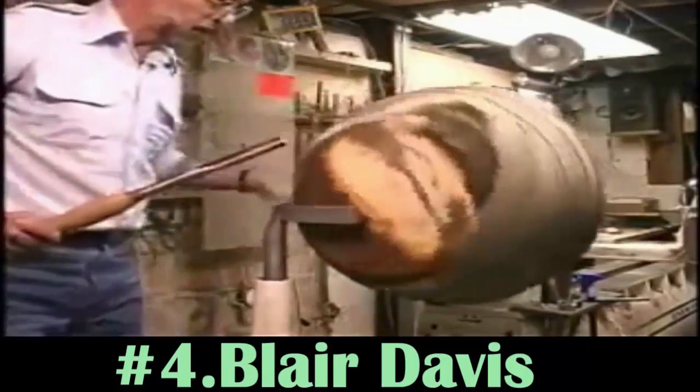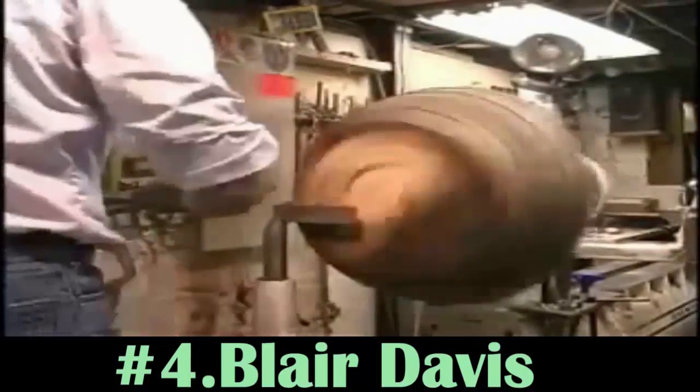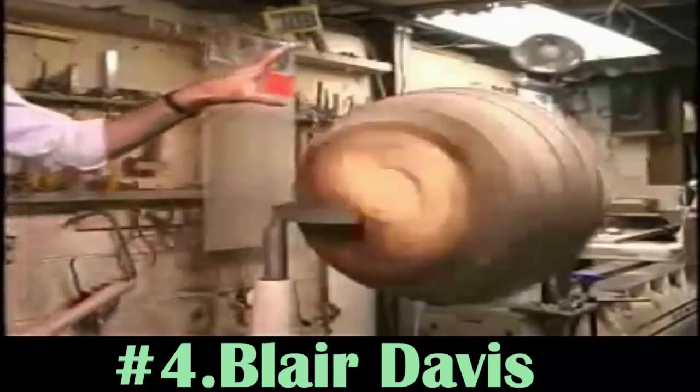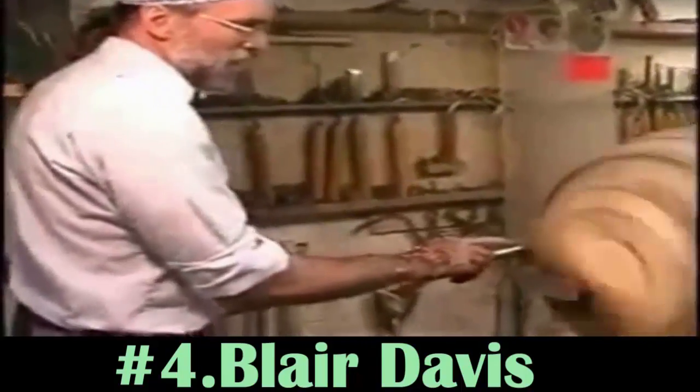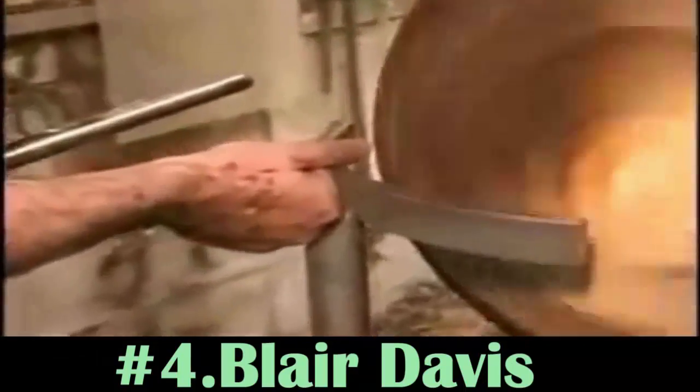Once again, we check for clearance. Even though it's more or less round, the difference in weight between bark areas and wood still gives it a fairly significant out of balance. As you can see here, I'm taking a fairly aggressive cut. I'm cutting probably half an inch of material off at a time, which you can do in green wood, but you would not be able to do if the wood was dry.